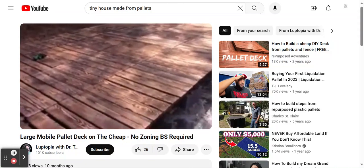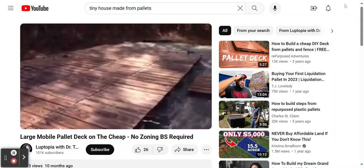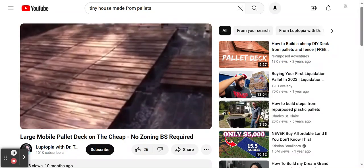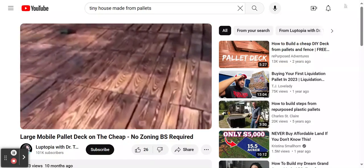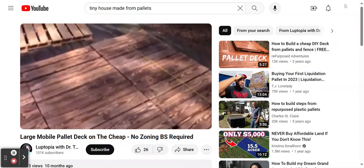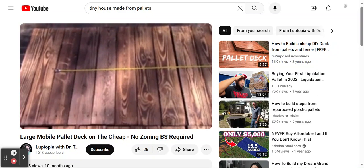As we put them together we put scabs in, though the center ones we just couldn't do. But if you put them all around the edges it seems to lock everything in place and it hasn't been a problem. We also burned the wood so it'll last a lot longer — we basically live in a swamp. It takes an enormous amount of time to bust the pallets up; on YouTube everybody makes it look so easy. Even with tools like a pallet buster it still takes a long time, and these boards are thin and break really easily.